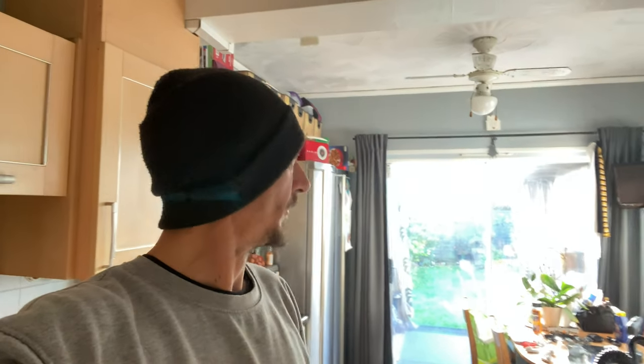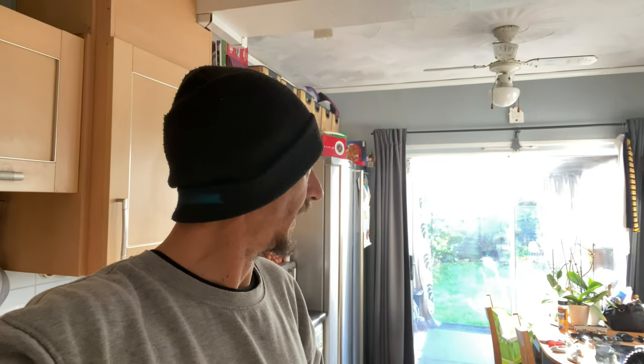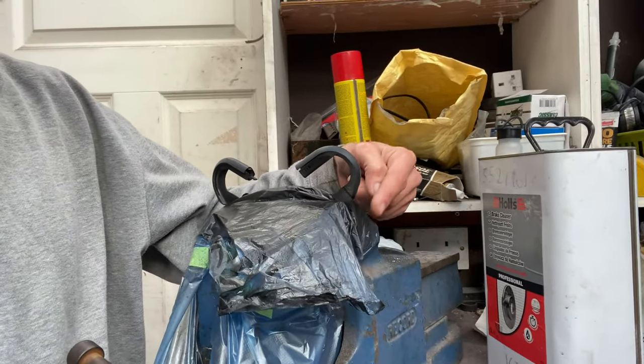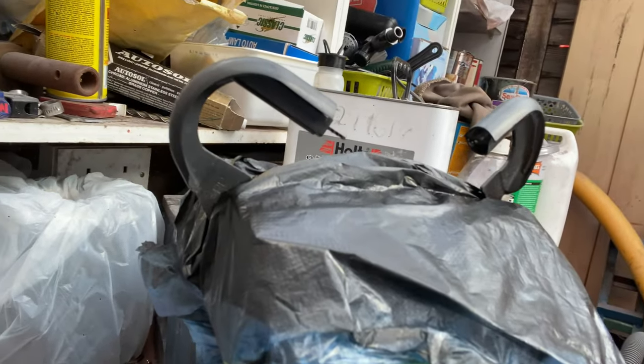The sun starts going down about three, so that's about four hours to paint everything up with fifteen minutes drying time between coats. I've only got one vice so I can only paint one thing at a time, which is an absolute nightmare. I can only spray so much at a time - you can see these, it must be where it's damp or something, but the colour of them is grey, not black. That's why I'm going to wait for it to warm up out here - I applied it in thin coats like all the other layers, and that worked really well, but that one outside hasn't worked. I reckon that's because it's a little bit cold and maybe damp.